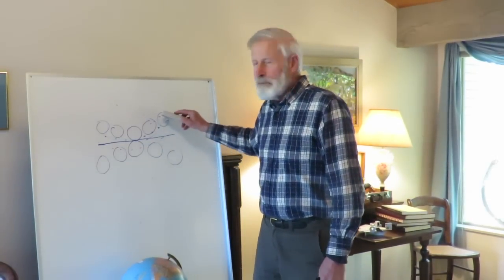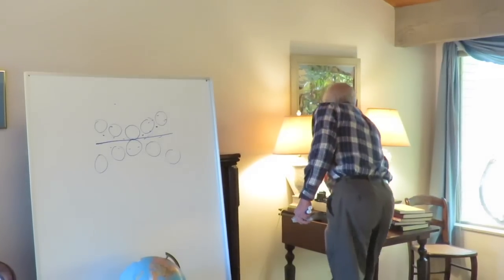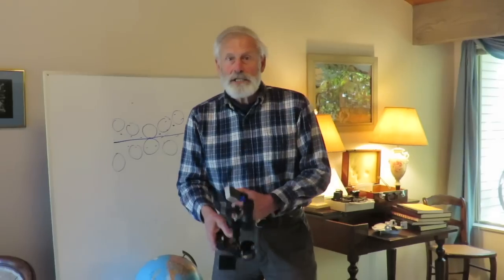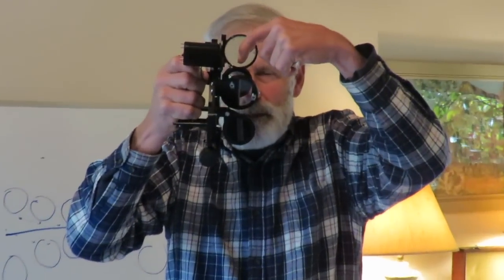The lower limb picture is correct, arcing the sextant, swinging the sextant. And you might have noticed in swinging the sextant that the part that's staying stationary is the upper mirror, not the eyepiece. That's the trick. You have to pivot around this point here. So that's what's staying stationary. That's why it's a little tricky to do it. You can't do it like this because you lose the star. You have to pivot it like this with this upper mirror staying stationary, keeping the star in the viewfinder.